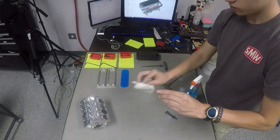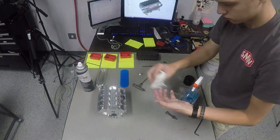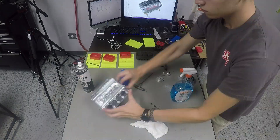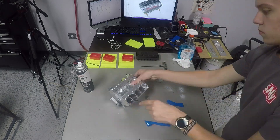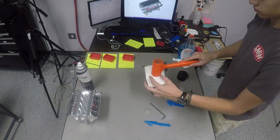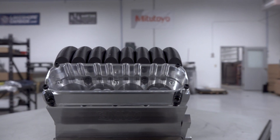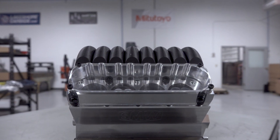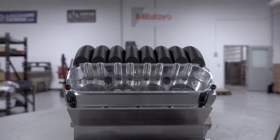The engine works great and it was a super fun project. I'd say next time we may want to machine the crankshaft instead of 3D printing it, because the filament is so hygroscopic that it becomes more and more flexible over time, which makes the engine harder to turn. But other than that, everything went great — I had a lot of fun designing and making this engine, and hopefully you guys had just as much fun watching. We'll see you next week here on NYCCNC.